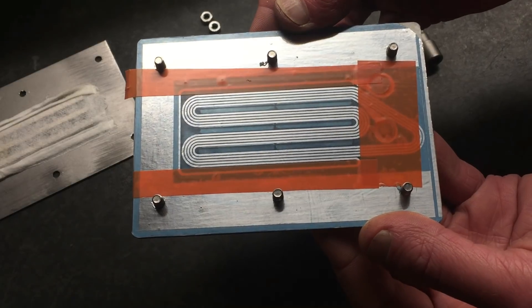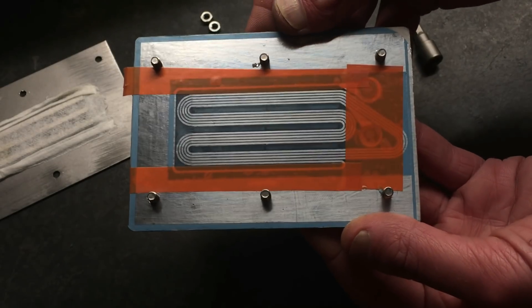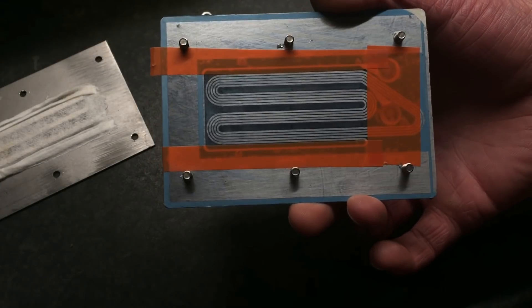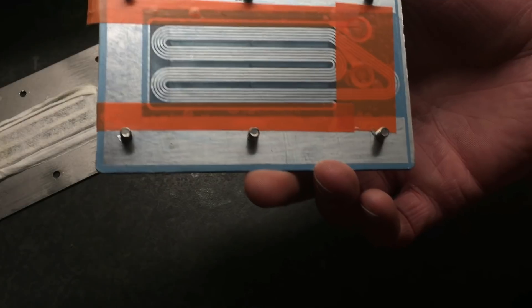This is the membrane, and since I used 9 micron aluminum foil laminate, it ended up with 8 ohm DC resistance. But actually if you measure the impedance it's like 9-point-something and it stays around this value, so it's rather high. I need thicker aluminum foil to fix this — that's not a big deal, I have it.